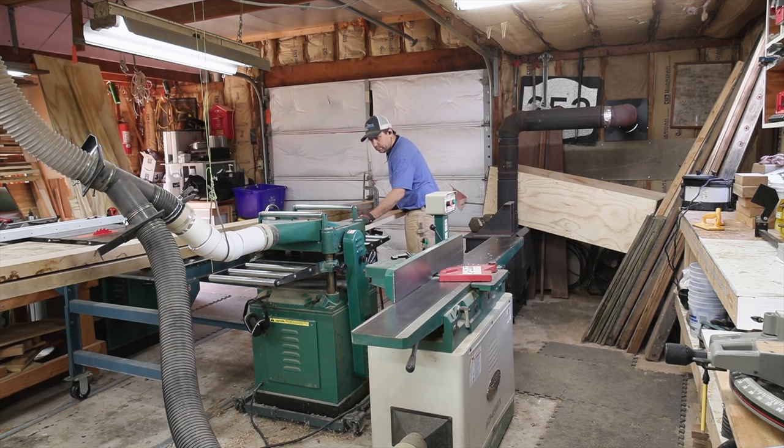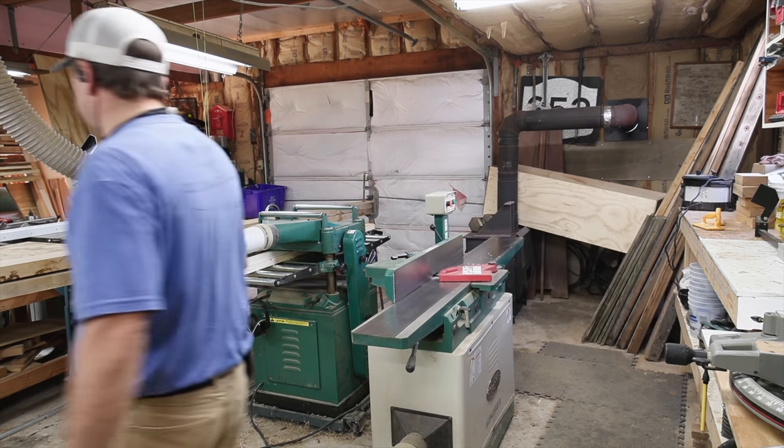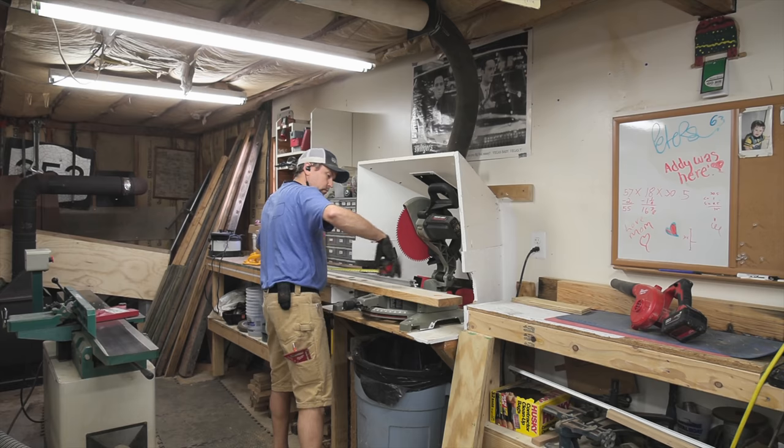Now because these forward deck beams are structural as well as a visual component of the boat, taking the time to do a longer scarf joint will pay dividends in the strength department.